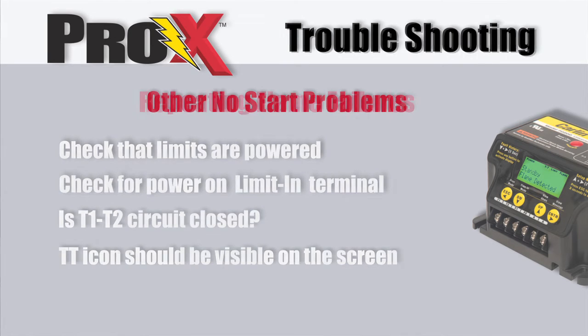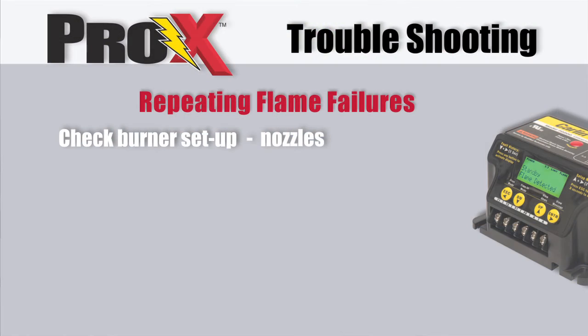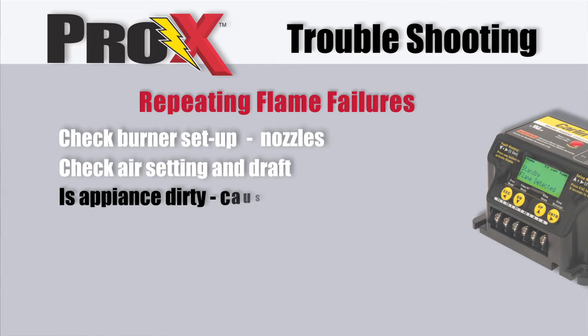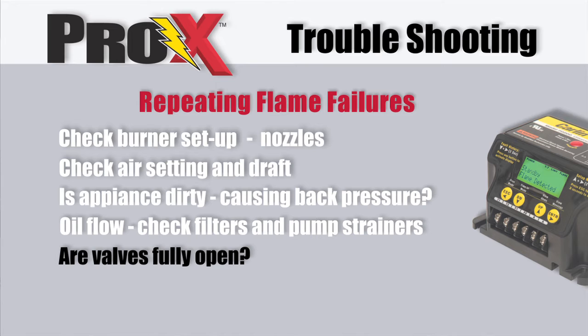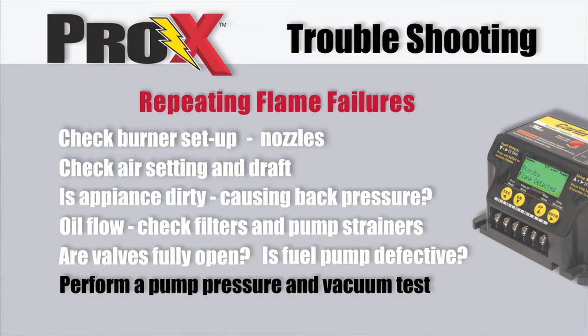If there are repeated flame failures, check the burner setup. Is the correct nozzle in place? Is the nozzle defective? Check for proper air setting and draft. Is the appliance dirty and causing excessive back pressure? Is there good oil flow? Check all filters and pump strainers. Are the oil valves fully open? Is the fuel pump defective? Perform a pump pressure test and vacuum test.